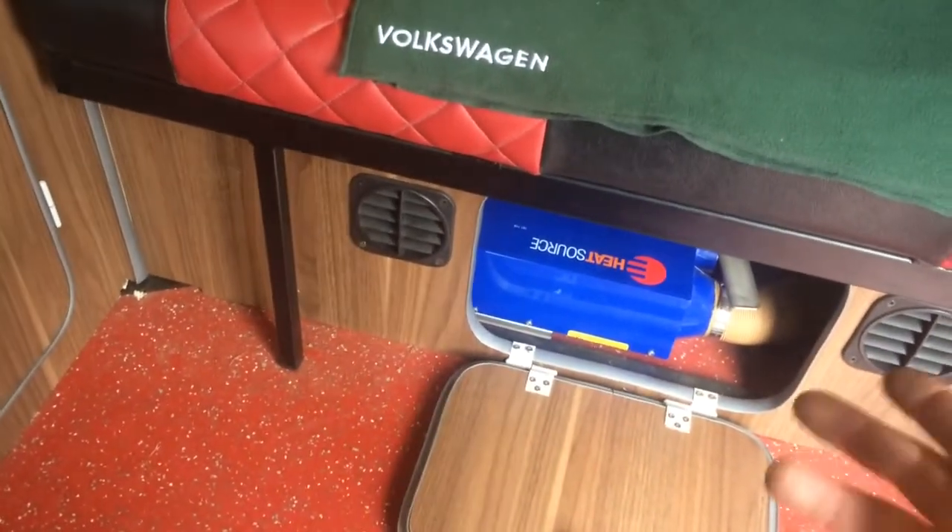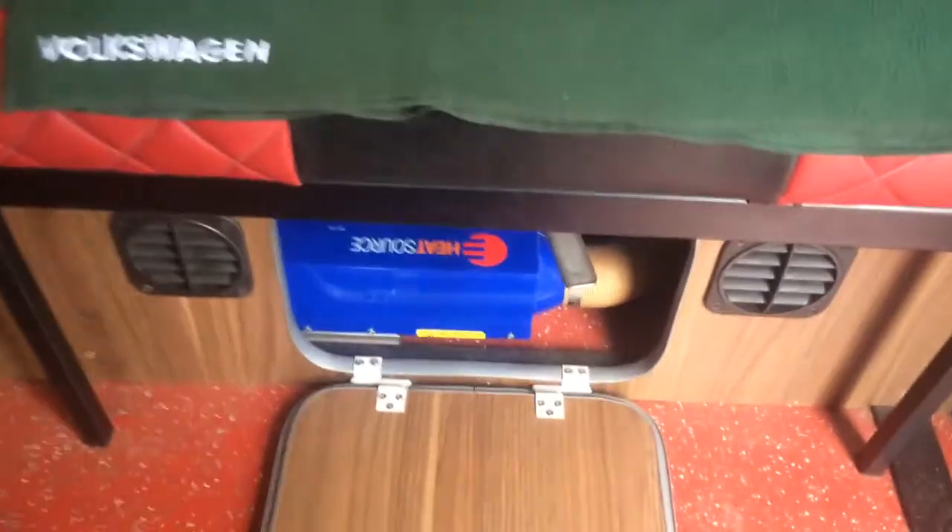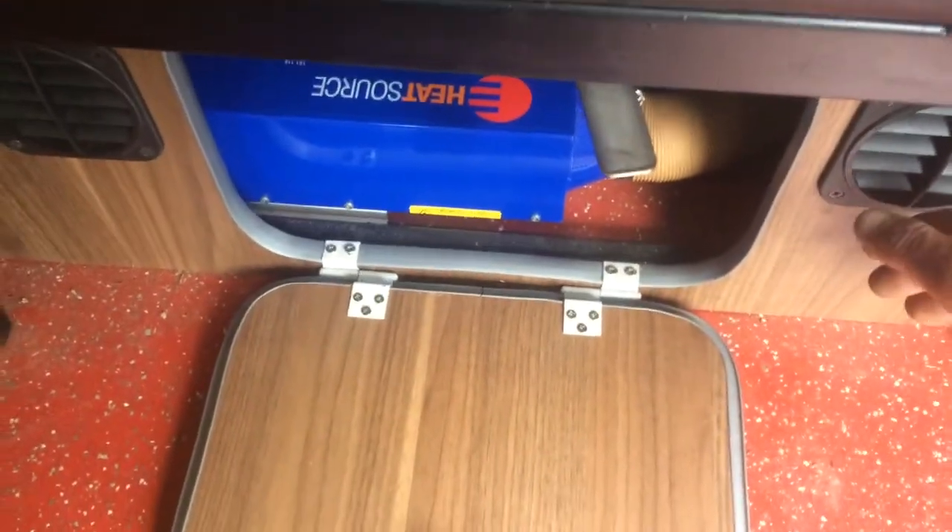When it spins you know you've got your power. There's nice warm air coming through here. Don't forget you'll have to turn your thermostat on to get it to light — turn it off, and back on to call for heat, and it'll fire again.